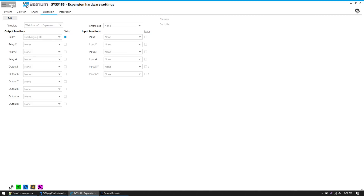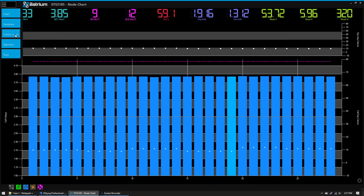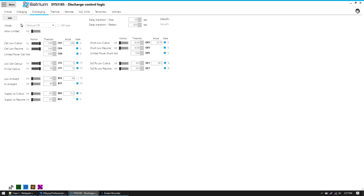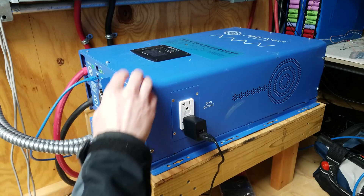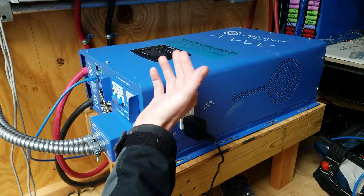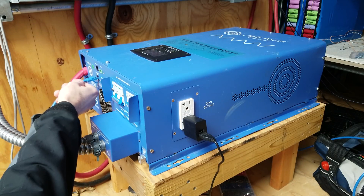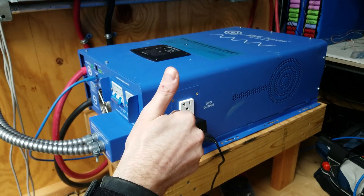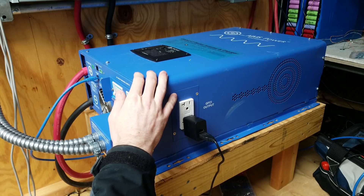So now the BMS will control this inverter — when it turns on and when it turns off. On winter days when I need to shut it down manually I can go through Control Logic > Discharging. I also want to configure a Wi-Fi switch so I can do this through Wi-Fi without coming into the Batrium software, but that will be a separate video. Our AIMS inverter is now controlled by our Batrium BMS, and again this will work with any BMS — all it's doing is connecting two pins together on the LCD remote RJ45 port. If you found this interesting please hit the like button, leave any questions or comments below, and thank you for watching.